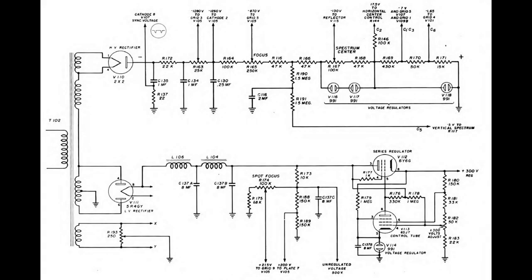Let's look at the power supply schematic. Here I've marked R163 — that is the intensity pot meter that gets very, very warm. I measured the output side that goes to cathode pin 2 of the CRT, and that goes really, really low. We already figured out that R164 is not getting extremely hot. So that means all the focus and the rest of the stuff to the right can't be causing the problem.